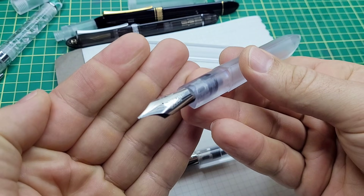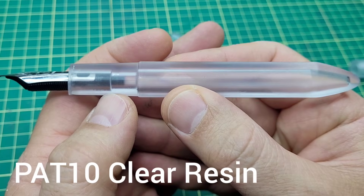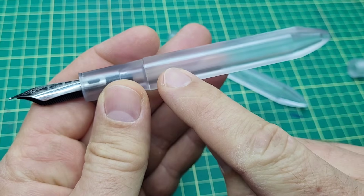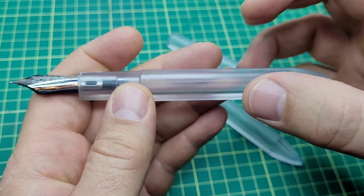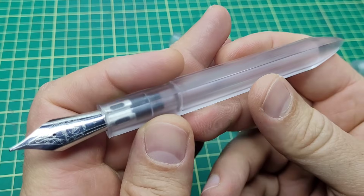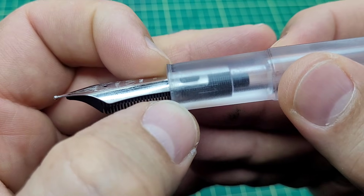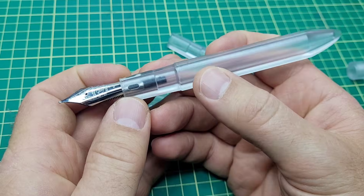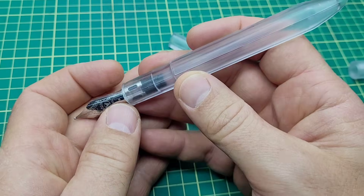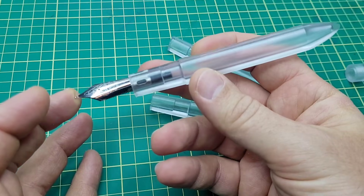It's reliable and dimensionally accurate. I'm looking forward to working with this PAT-10 clear resin more — I still need to work on some finishing. They do have a varnish you can apply afterwards to really make things pop and make it clear. They say transparency is 88.5%, which is quite high, with medium to high toughness — good for the slip cap mechanism I'm working on — and long-term it's non-deforming and has anti-aging properties that resist yellowing. I'll be doing a follow-up video on this resin.